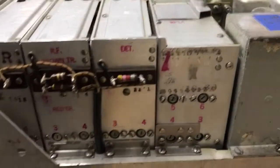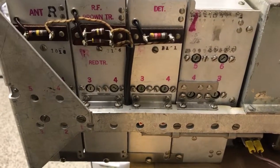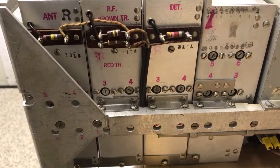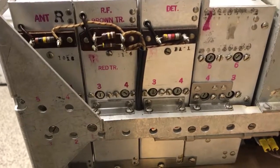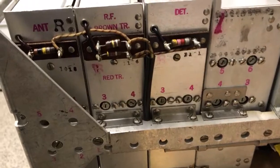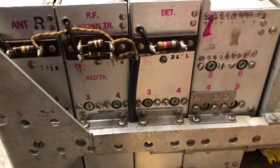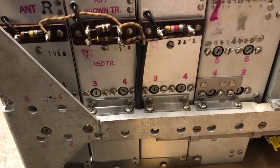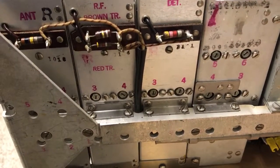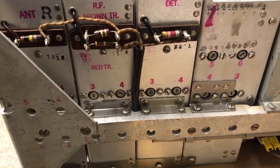What's really important is to adjust the antenna, RF detector, and oscillator trimmers in the back here to make this radio work properly. So the first thing you want to do is adjust the oscillator. There's going to be an adjustment for each band, one through six. The oscillator is simply a dial calibration point for each band, so that's going to be your choice of where you want the dial to line up accurately.